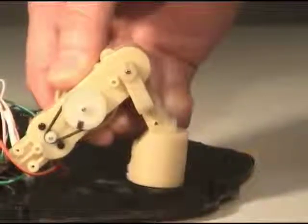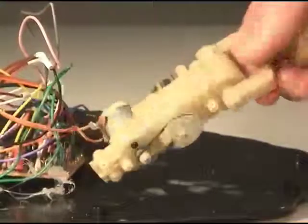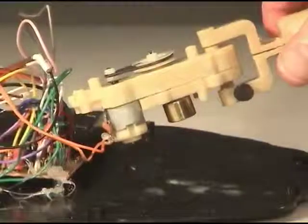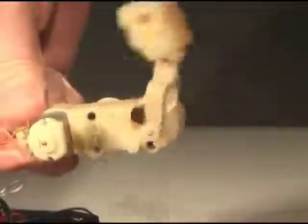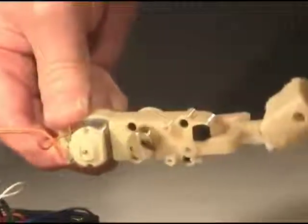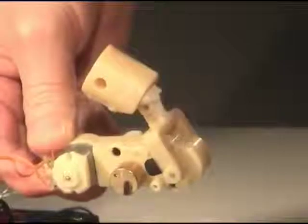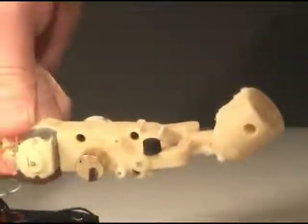And all the shaking is because of that offset brass weight that we'll see in a minute. Here's the brass piece on the other side — there's a shaft going right through the gear train, and you can see the shaft is on the very edge of this brass weight. I put a black mark on this weight too so we could watch it move. That thing spins all the time, so the unit is vibrating all the time — we just don't notice it much until the thing comes to a stop and we really notice it. Pretty creative stuff. That little black bumper, when the brass cover was on, would bump up against the cover just to lessen the blow. I'll be pulling that shaft out of the pivot point too.